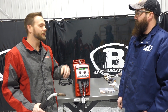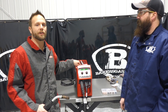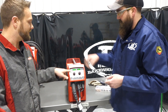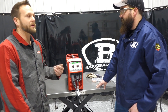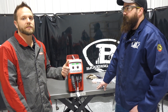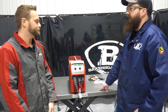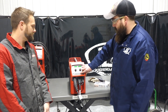For those who don't understand inch or fraction, there is a chart on top of the machine that references it to gauge. So if you know gauge, you can always reference that chart. I always suggest material thickness is a starting point. If you've been welding for many years, you can go off wire feed speed as well. The benefit of synergic mode is that wire feed speed and volts are combined, making it easy for the user to set up based on material type — you don't have to independently choose them.